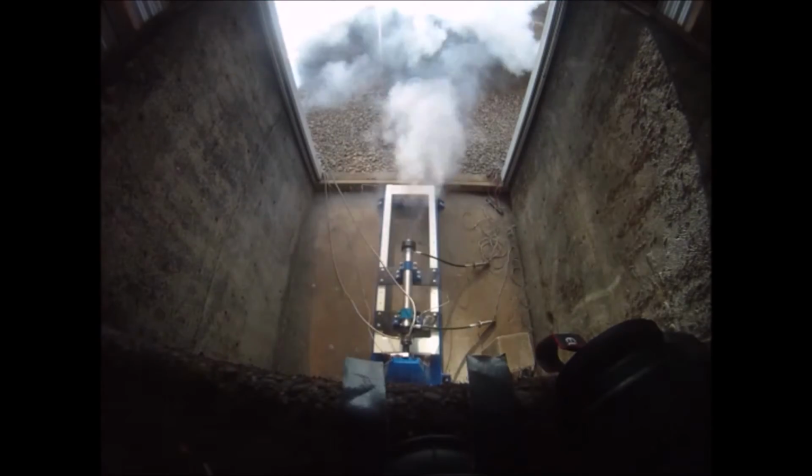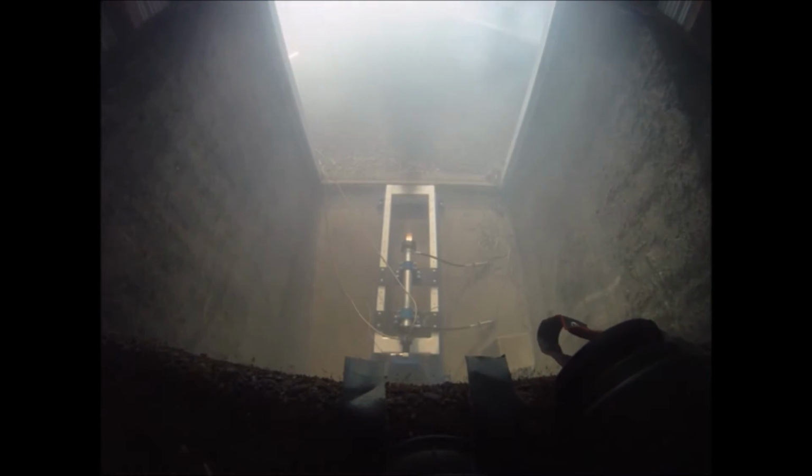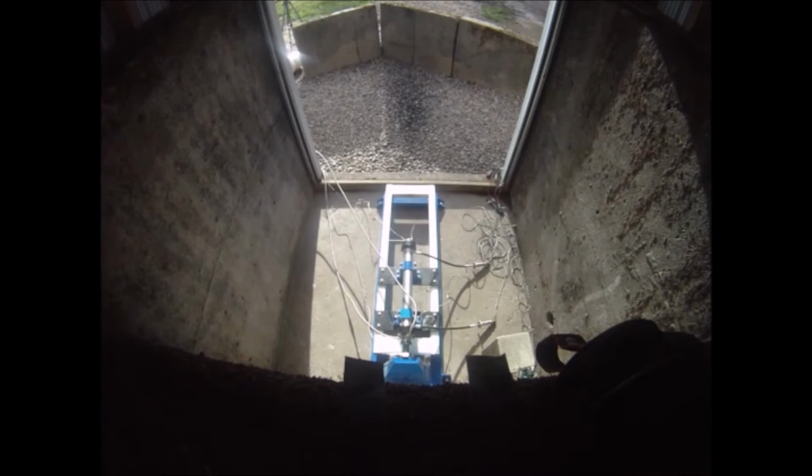In addition to these tests, which were used to prove the system requirements and the extent of their abilities, these sensors were deployed in the various test fires that the hybrid rocket team had put on. The load cell was mounted right behind the motor cylinder. The pressure transducers were connected to the piping on the front and back of the motor cylinder, and the strain gauges will be mounted to the final motor cylinder in the future.